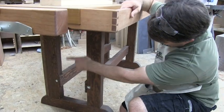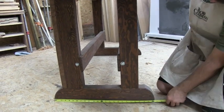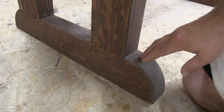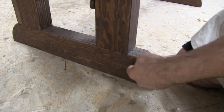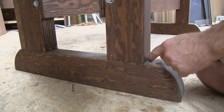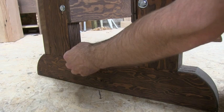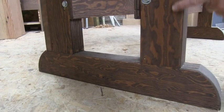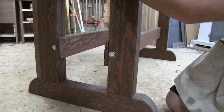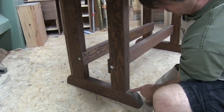If you look at this end trestle, the foot is 24 and a half inches long, made up of four pieces of 5/8 inch plywood glued and stapled together. The staple simply holds it in place until the glue dries. The first piece is the full 24 and a half inches long. The next piece goes from here to the edge of this leg, then we leave a space, then a piece goes from the inside of this leg to the inside of this leg. We leave a four-inch space, then another piece on the other end. Then the leg itself is made out of four pieces as well — the outside and inside pieces run from right here to just underneath the top stretcher, and the next piece goes the full length, filling that gap.